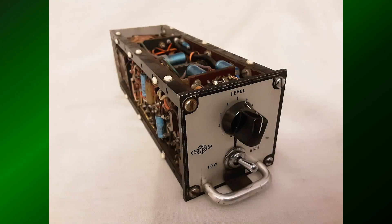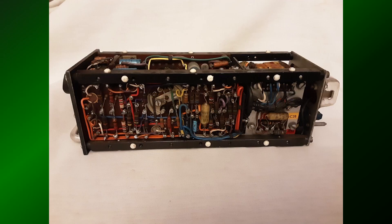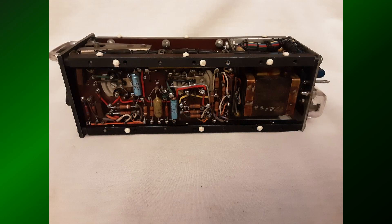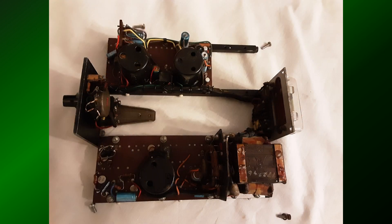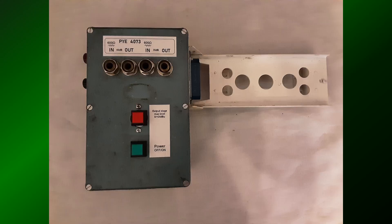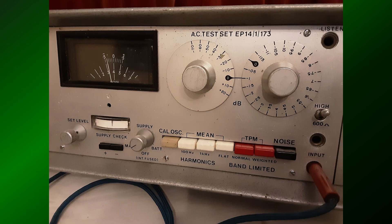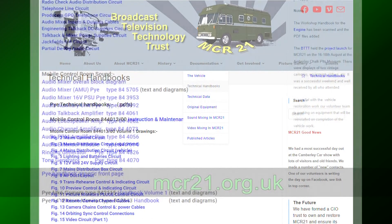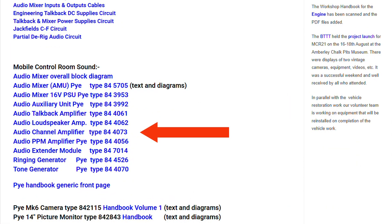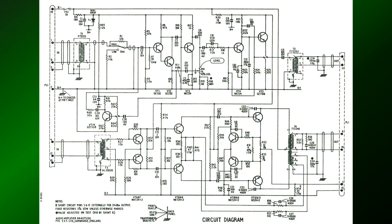Here are a few shots of the modules as used in the sound desk of MCR21. As you can see, there's no sign of any PCBs from this era — it's just jam-packed full of 60s germanium goodness. They do open up to allow access to the interior for servicing. One of our volunteers, Steve, has built a rather lovely jig which enables us to run these modules on the bench for testing and fault finding. Let us know in the comments below if you'd like a future video that delves deeper into the restoration of these modules, and in the meantime, head over to the MCR21 website where you can download the circuit diagram and description for the Type 4073 channel amplifier.